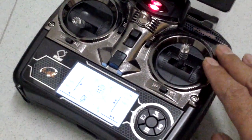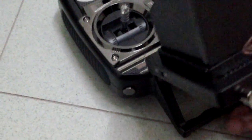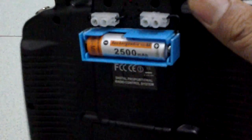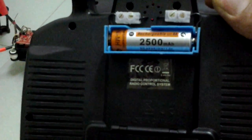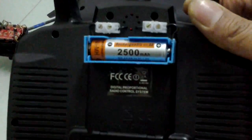It's not a six-volt, so what I have to do to resolve that problem — I added one more battery tray for the rechargeable battery. I just looped one more battery tray outside on the transmitter. I just took off the cable from the transmitter. I use a 2500 milliamp battery and the voltage is 1.2 volts.